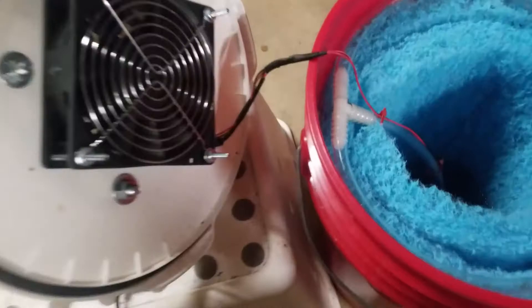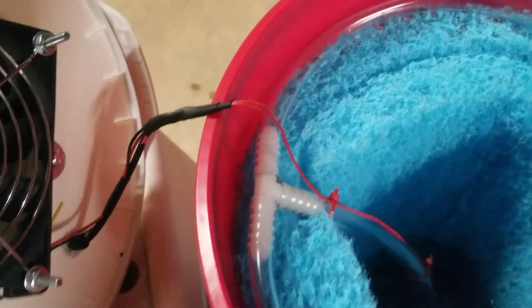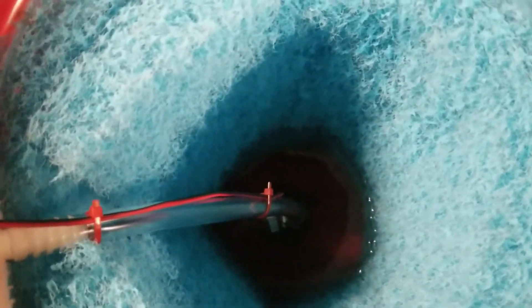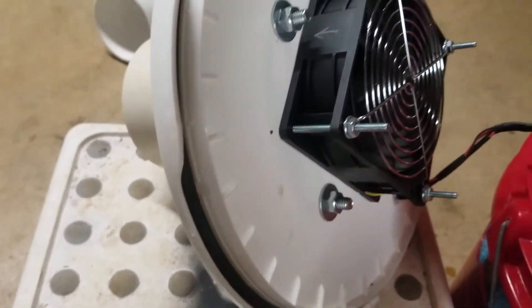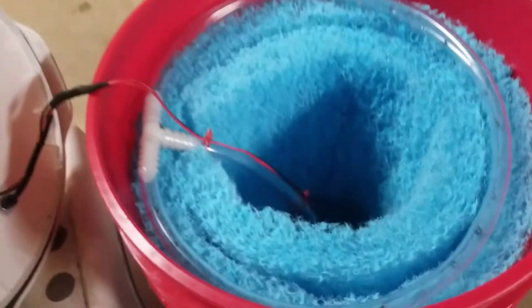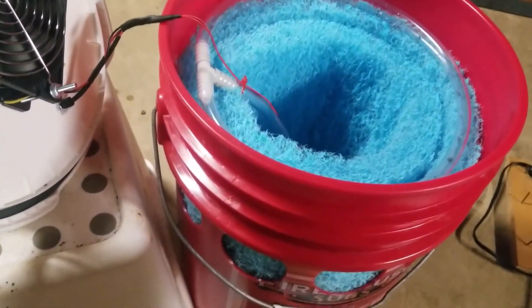Alright, here's where we are. I have wired the fan to the power lead. Inside that bundle of shrink tube the power lead, the fan, and the pump are all together - black to black to black, red to red to red. I've dumped about a gallon of water in there so the water level is up to about that white line, maybe a little higher. We're going to go ahead and test this out. Fan is screwed down with a little blue Loctite on the threads, screen is on there, it fits nicely. I'll fire it up and just make sure we're getting good water flow around the ring.